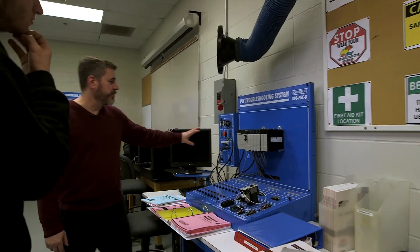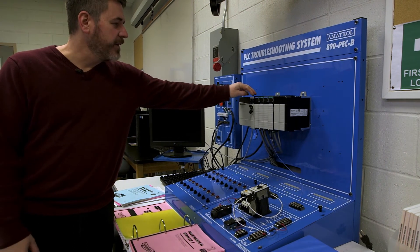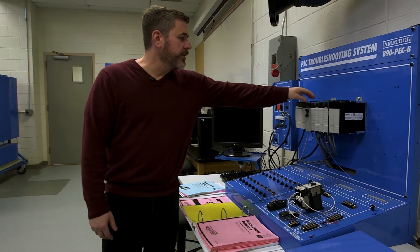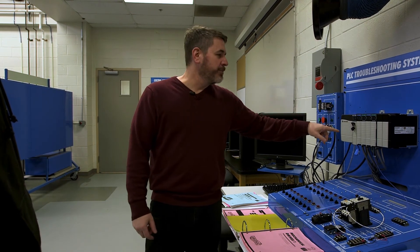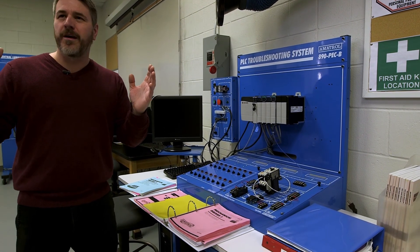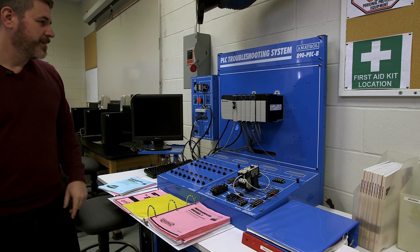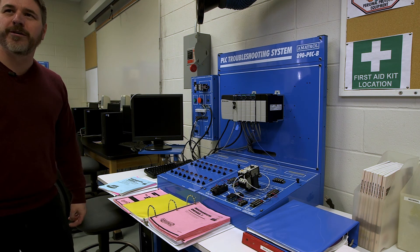This is a PLC trainer. The PLC has a power supply, a brain for computer processing, and inputs and outputs. If something turns on — a contact pulls in — there's a signal that goes back to the PLC telling it that thing turned on, which is an input. The computer then tells a relay to kick in as an output. When we watch the whole nacelle turn, the PLC sends a digital output signal telling the motors to kick on. That's the basic idea of what the PLC is doing — it has the whole program written for controlling that turbine.